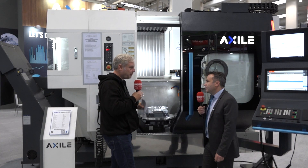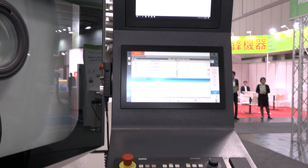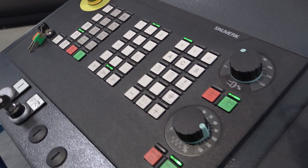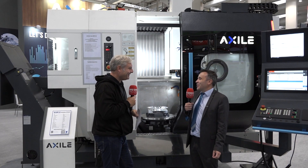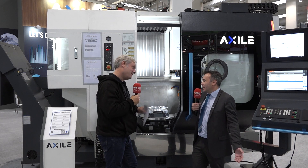With the complexity of components and lots of tools, what controls do you run on this machine? The big advantage of our company is that we can supply a flexible approach to controls. We have Siemens on this machine, but we can also supply Heidenhain — both versions — and Fanuc, all full 5-axis simultaneous controls. A lot of machine shops like to stick to one control. This is always challenging to discuss, but we are flexible on this aspect. Some machines are in stock and available on quick delivery from ETG.